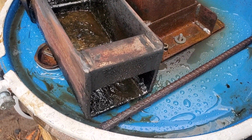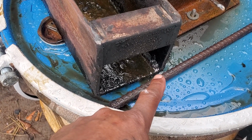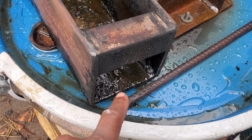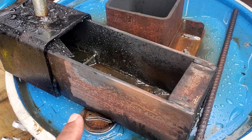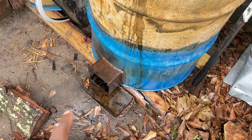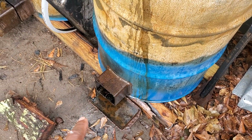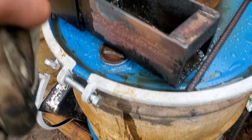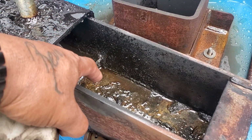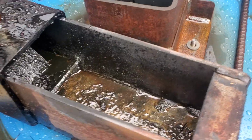The design flaw, again, this should be blocked off, welded, watertight, okay? And remember, I was saying that we adjusted this drawer in and out of the foot to get the air that we needed. Well, that was hurting us because air coming through the top was hitting the flame and batting it down. So, again, design flaw.